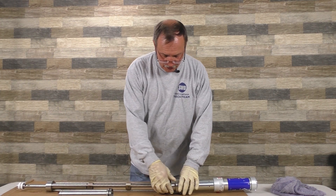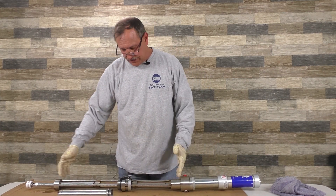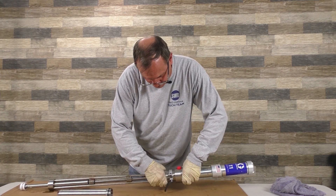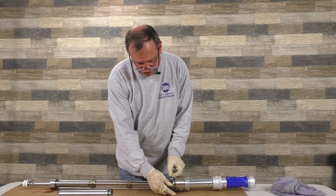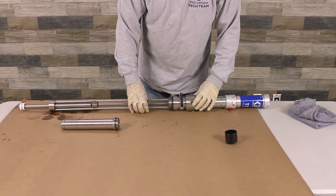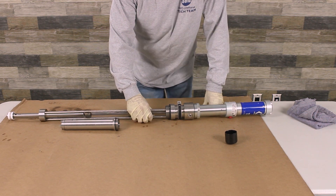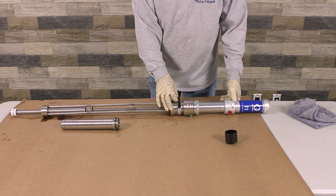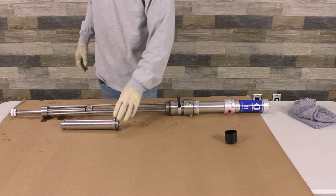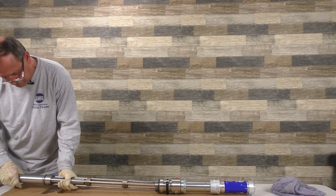We highly recommend that you have a bung for your barrel. This part is adjustable, which lets you set the correct distance off the bottom of the barrel when you're spraying, and it holds the pump in place. These are adjustable for tightness — just screw this little screw down to tighten it up. The pump has two holes — you'll see one here and one here. A lot of pumps will have the outlet come out of one, and the recirculation line going the other. There's an air valve that goes right in here that you can adjust, and there's a grounding strap you can put on if you want. As you put this in, make sure it slides in place — it'll slide fairly easy and you'll hear it pop, then tighten it down.